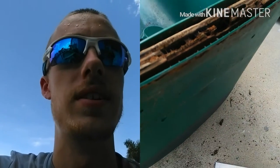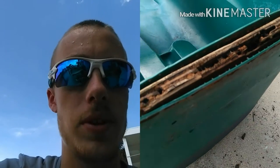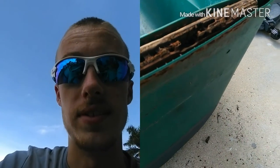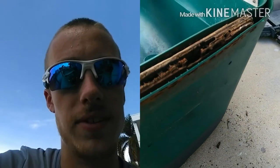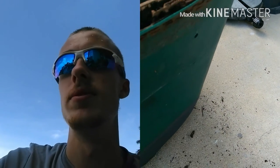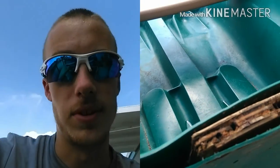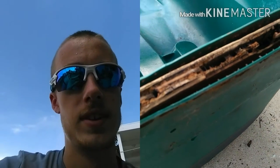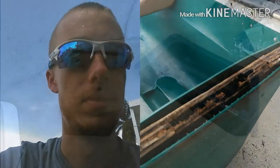This wood is completely rotted. I wasn't planning on having to do any work on the transom like this, but luckily I have some wood I can replace it with. I'm going to pull this old piece of wood out and use it as a template to cut a new piece, then slide it back in. The jack plate is going to put a lot more stress on the transom than just mounting the motor regularly would, so it definitely needs a new piece of wood. Might as well do the job right. So if you ever wanted to know what was inside your canoe transom, it's probably something similar to this.